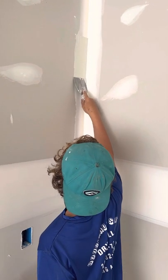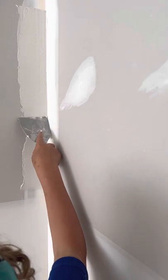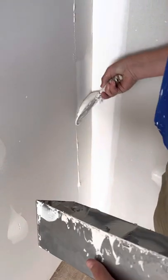He's going to try to spread the mud down — keep going. This is more of what a newer finisher is going to run an angle like. You can see he's got a lot of mud on the other side. He's done a couple of them in closets and I'm trying to teach him to spread his mud evenly, which is the way it needs to be. It takes a lot of pan work to get used to the knife.